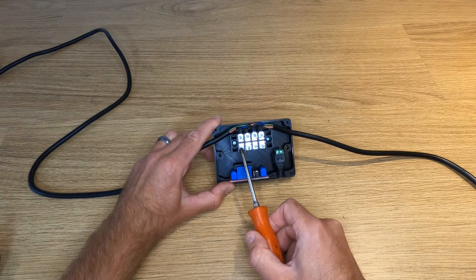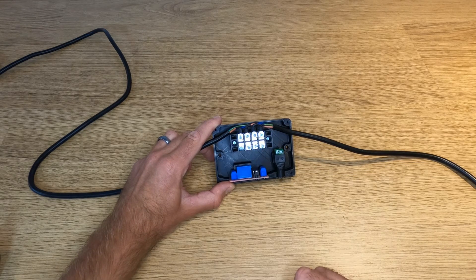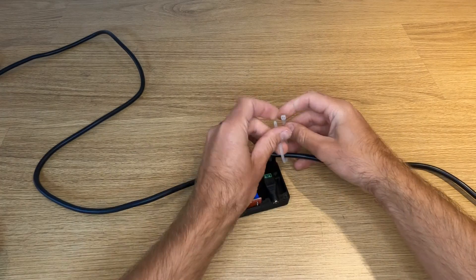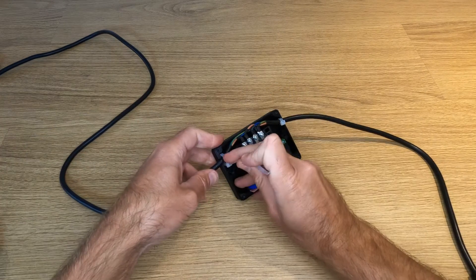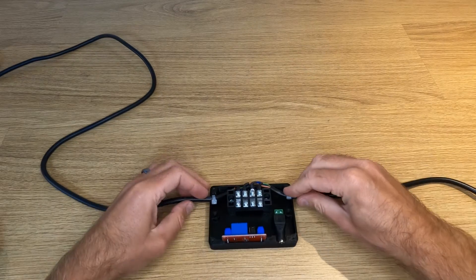This way we have broken only the live wire and have two terminals that we can connect to our relay. The relay will connect and disconnect these two terminals, effectively connecting and disconnecting our live wire. We also need to add some strain relief to the cables so that if they're pulled, the connections inside will not be affected. This can be done with a couple of cable ties as shown.